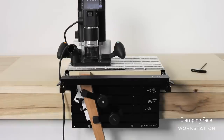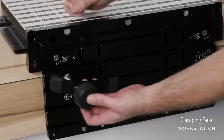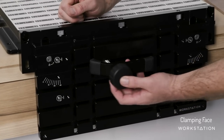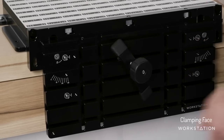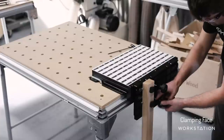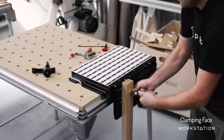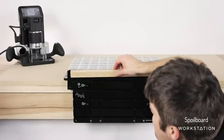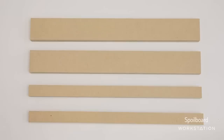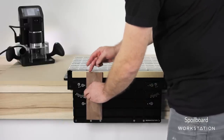Here are some examples using the vertical alignment pins. We ship with two clamps with the Shaper Workstation — you can see they work great for most situations straight off the bat. The T-slot is industry standard: an 8mm slot at the top with a machined 15mm T behind it. Most standard clamps you have sitting around that are designed for T-slots will work in here perfectly well too. The spoil boards are made of nice MDF, 25mm high and 50mm high. We ship two of these — they're user replaceable. You can make your own, and we include the dimensions in the manual.